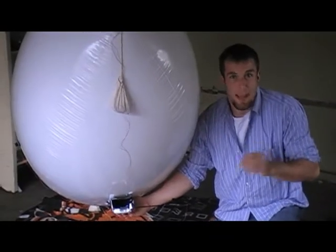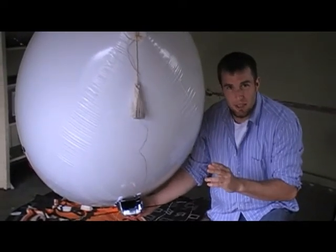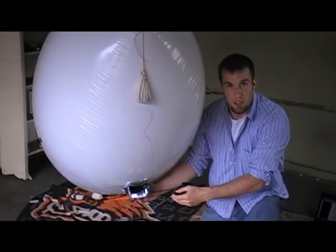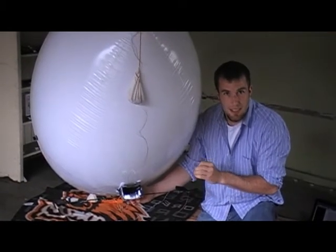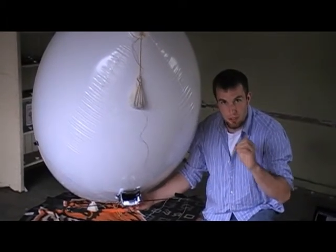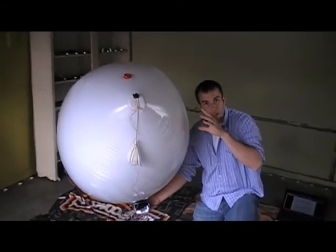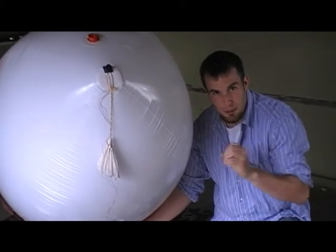Now it would be fair to describe the microcontroller as the brains of the blimp, and the power supply as the heart. As for the muscle, well, let's take a look under the hood and see what we have going in the propulsion system of this blimp. There are really only 3 active components in the propulsion system. 2 propellers, mounted on a long straight axle, attached to a servo to control propeller pitch. Each of the propellers is then fed an analog DC voltage, allowing independent velocity control, which along with the servo allows us to control both the velocity and the altitude of the blimp. This whole propulsion system is mounted onto a custom designed gondola attached to a 6-foot polyurethane blimp from Mobile Airships. Together, this makes up the total mechanical portion of the blimp bag itself.